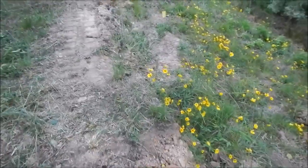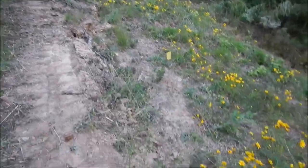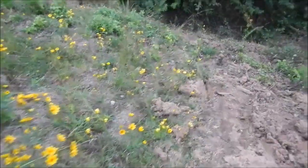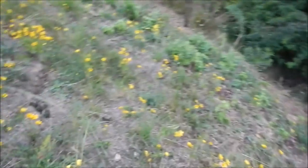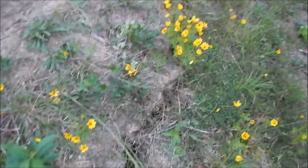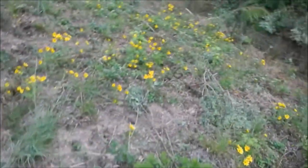The dirt was put in loose and wasn't compacted, and as it's gotten wet it started actually cracking and sliding off the back of the pond dam — sliding down it. As you can tell, it's very steep. See the drop-off right there where it started pulling away, and you've got cracks in here all the way down.